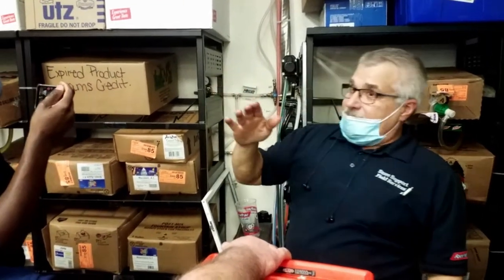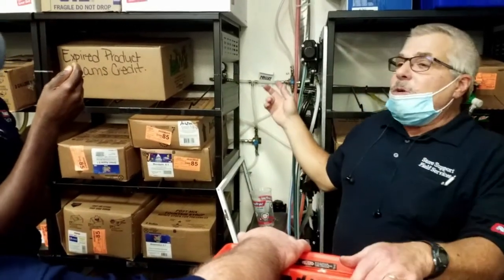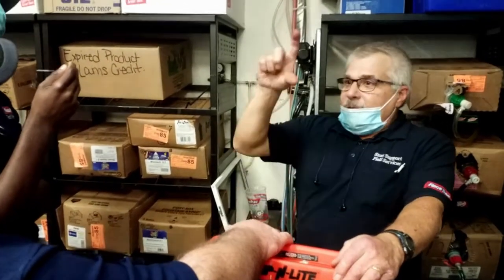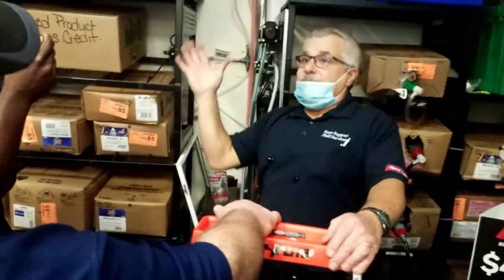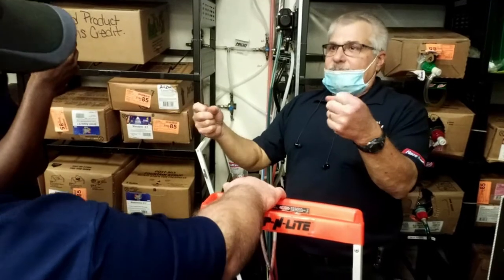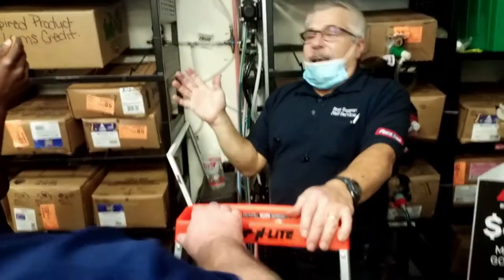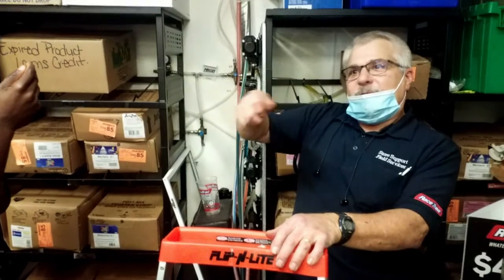If it goes down to 60 before it comes back on, what's going to happen? Somebody's going to get a soda. Now at 60 pounds of syrup pressure, you've got not enough syrup. When the air compressor comes back on and it's 80, now you've got the right pressure. So you're going to have inconsistent drinks. Adjust up the pressure switch on the compressor to kick in at 80 and out at 100. It's just the turn of a screw a couple times.